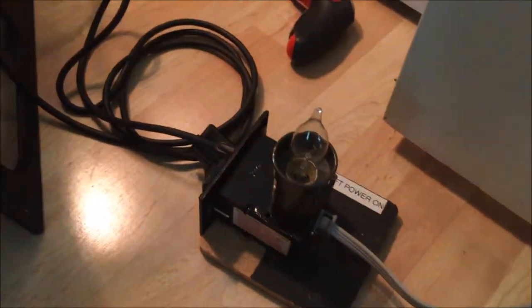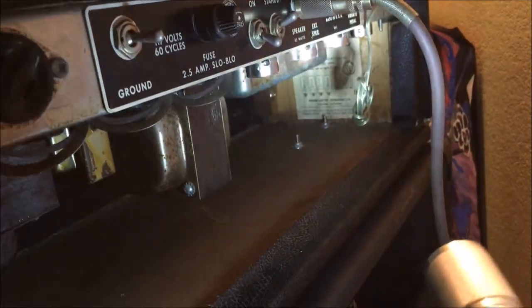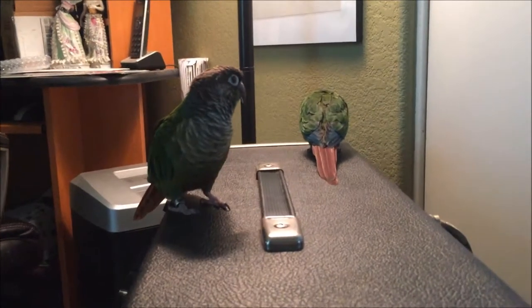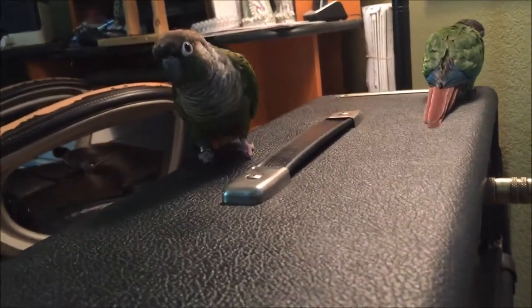What I've decided to do is pull all the power tubes out and power this up using my light bulb current limiting arrangement here with a 40 watt bulb, and just turn it on and see what happens. I asked some people online in a forum what's the best way to do this, and they all said just don't even turn it on, replace all the caps. But I really don't believe I have to replace these electrolytics — I think if they're gradually exposed to higher and higher voltage they'll reform. I should also introduce my technical advisors, Ringo and Ollie. They're inspecting the amplifier to make sure it's all good.